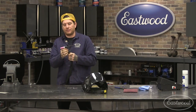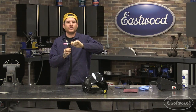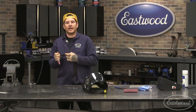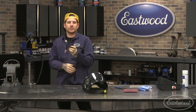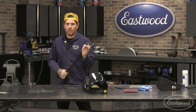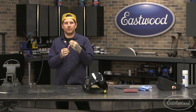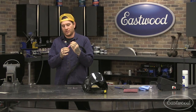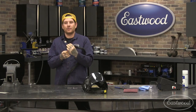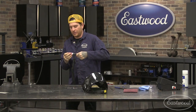Sometimes, like I've referenced, if you're welding in an odd angle or a weld joint that has a real deep V, you may need to change the angle that you're welding at. But generally, you're not going to change it from aluminum to steel. The angle is going to be basically the same. You don't want to open up your angle too much, which we're going to show in a second here, because it will make your arc go across the workpiece instead of down in it, which is a common problem that we have. That's a good question. I'll definitely show the angle here in a few.